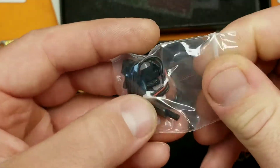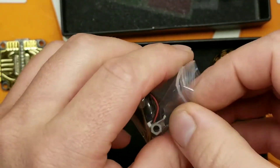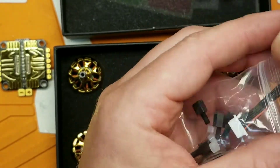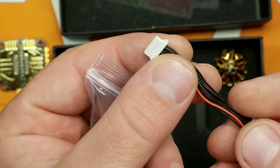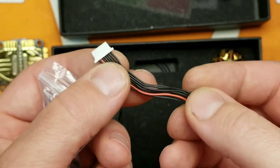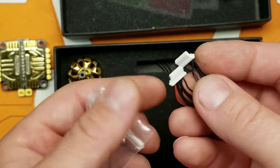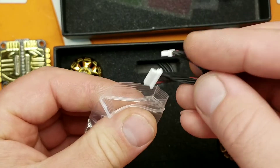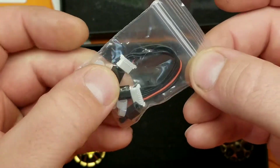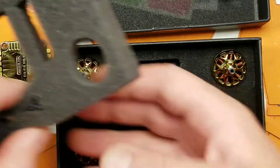In this bag we get some mounting hardware, some standoffs, and our connection cable — it's pinned at both ends, intended to go to a compatible flight controller. One word of caution: double, triple, and quadruple check — get a friend to verify after you hook it up. Don't assume you can just plug it in and it'll work. You could end up frying components if power and ground go to the wrong places.